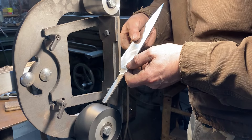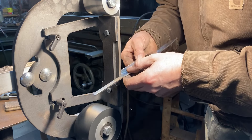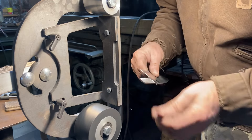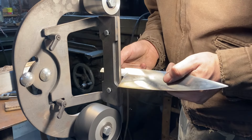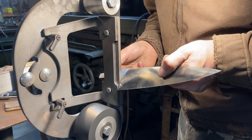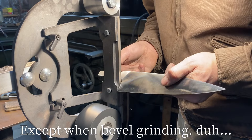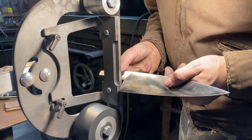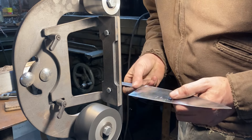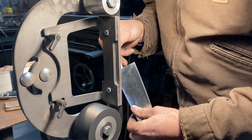The last kind of step I'm doing here is putting that final convex shape on the heel of the knife, and then a little bit later on the spine. I'm doing this on the left edge of the platen on the left-hand built Brodbeck grinder — this thing is built opposite to most grinders, assembled in reverse. So I'm just rounding it from that side. And from this side of the platen I can get the bottom of the choil on the other side of the knife. You don't ever want to be stuffing steel up into the belt — you want it to be like a trailing edge on whatever you're grinding. Get about vertical, but not continue to where you're pushing things up into the belt. I can do those two surfaces from here: the marked side of the heel and the reverse side of the bottom of the choil.